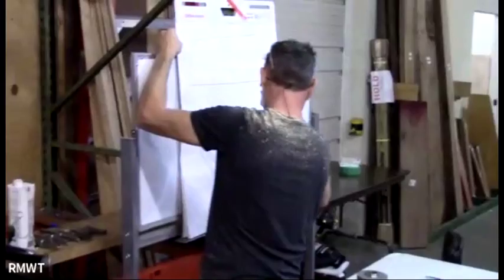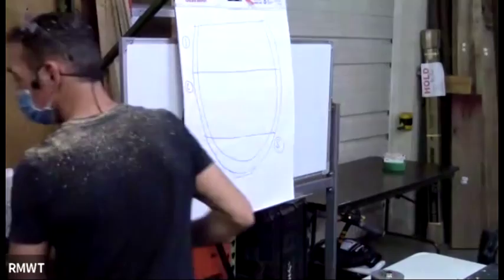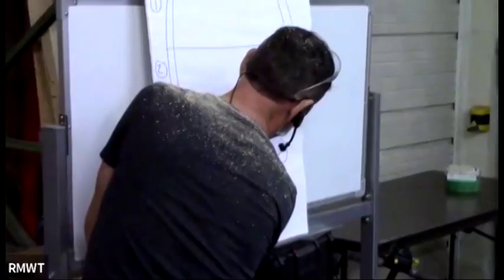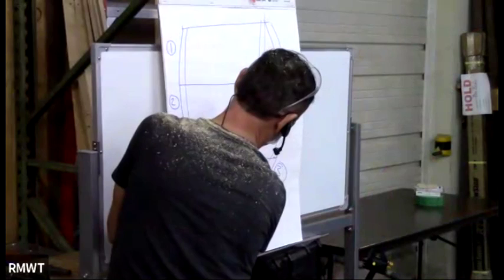So the problem we've got is getting to the middle on the very tall bowl. You can see it is a different angle to the angle that we need. So if you look, you need to get your bevel in contact, so that's your bevel, and then you draw your angle up. That's a pretty steep angle there on that gouge. So that angle is from there to there.